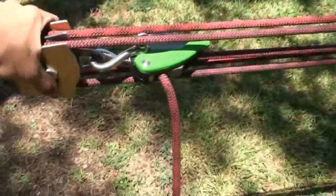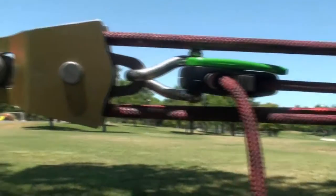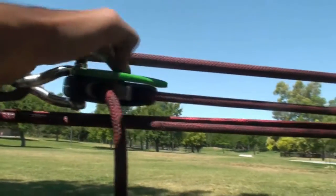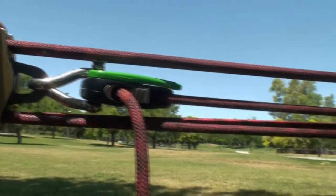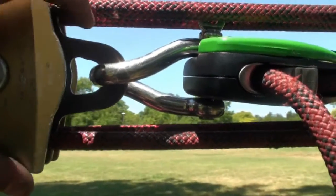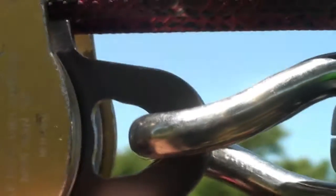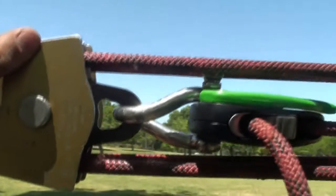Before we get started, we've got the Eddy embedded in here. As I noted before, it fits super nice in there. I'm using the SMC 3-inch pulleys here. There's a ton of room, and I can see that accessing the handle is going to be really simple. Something to note: I'm having to use a 12mm twist shackle, as it will not normally fit through the becket. I have dremeled out my becket a little bit. The shackle will not normally fit through the becket hole. I have a feeling the 10mm twist shackle might work, but I'm not sure — I haven't tried it yet.